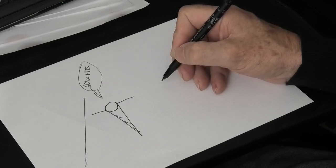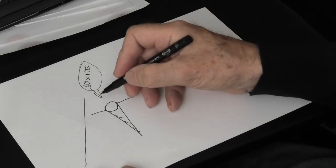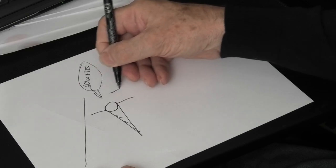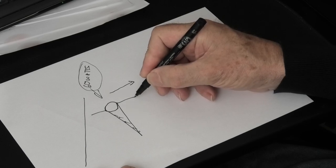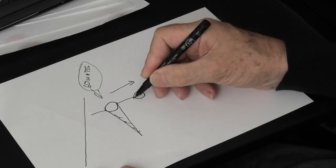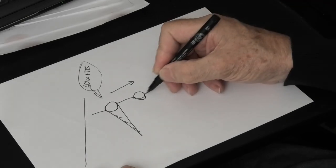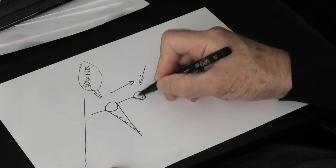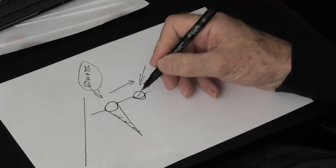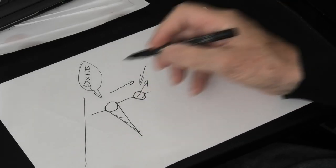Wood is not a material. It's a mixture of many different types of material. And so consequently, as we pass our laser beam across the work, if we come across a different material, the chances are that we're still going to produce a hole, but it may only be a shallow hole like that. Now, if it's a shallow hole, the light can go in and the light can come out. You will be able to see what's in the hole. Here you cannot see what's in the hole, so it looks black.